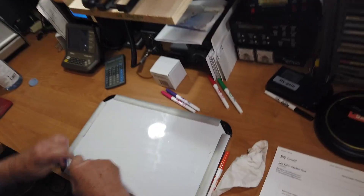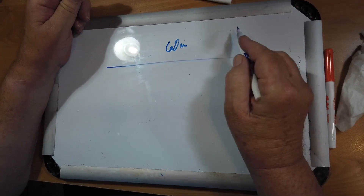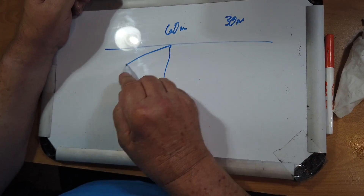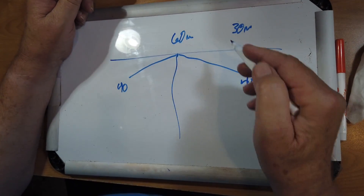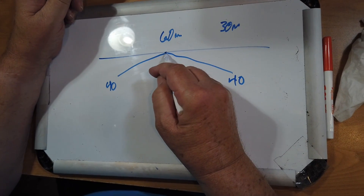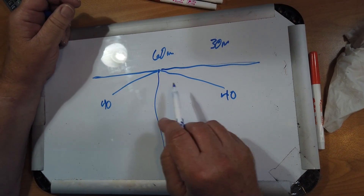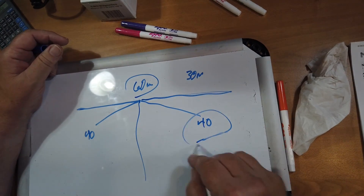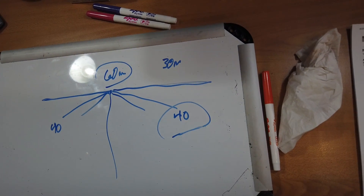But normally, you could do a fan dipole — you could do something like this. Here's your 60-meter antenna, which is a half-wavelength of 30 meters long. And then at the feed point in the middle, bring out your 40-meter dipole. That should work. You may have some fun issues getting that tuned up because each one is going to affect the other, but it could work very well if you want to use both bands. And of course you could stick 20 meters in here too and do whatever you like.